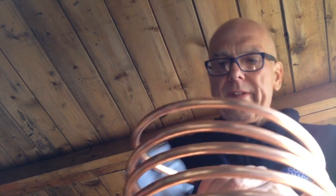So let's let it get warm for a start. It shouldn't take long. And then just tuck it. There it is. And it just sucks in with the capillary action. There we go. Then, like I say, get a bit of cloth and just wipe the surplus off, but being careful not to touch the actual metal, just wipe it clean. There you go.